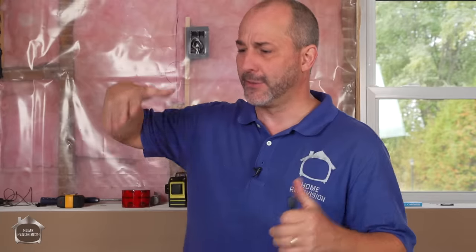But in most residential situations, if you're using Type X firewall board, it's because you're in a row house or you have a semi-detached, and the building code requires a fire separation wall between the two dwelling units, okay? So if you have a bathroom that you're renovating, and that bathroom wall is on your neighbor's side of the property and you're sharing that wall, that drywall has to be Type X. So you want to put in your fire rating wall first, then put in your moisture board, okay? Very important, you can't cheat there because it's a matter of liability in case something goes horribly wrong.